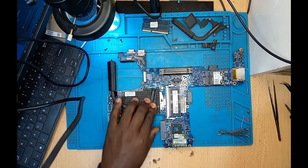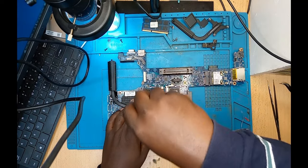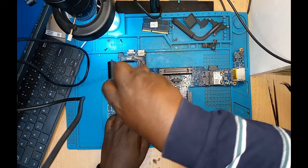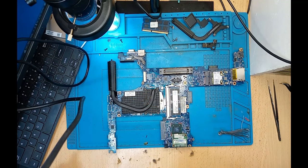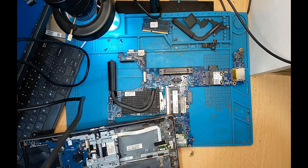So guys, don't power on your motherboard without taking back the heat sink. You will damage your processor. Your processor will go nuts. It's too hot, guys. Also try to make sure that the thermal paste is up to date. Wipe off the old thermal paste and place a new one. Thermal paste or thermal pad, any can do, as long as it's transferring heat from the processor to the heat sink itself. So, coming with the screen,